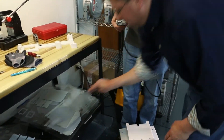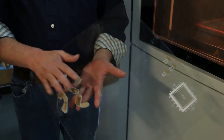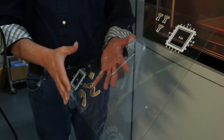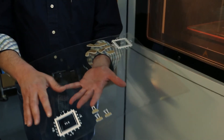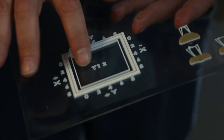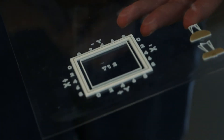We try to avoid that as much as we can. So tell me a little bit about the build plate. This is just a polycarbonate sheet that goes into the machine and gets sucked down to a vacuum table. You can only use one area of the build sheet once, and then we save the sheet so we can utilize the rest of it. So it's inexpensive and it's quick to just change these out. The calibration — you actually calibrate the two nozzles together. You're calibrating your X and Y using this scale here, and then calibrate the Z on this square here. This tells you what tip is in the machine, so you know that you have the right settings on it. If you try to calibrate with the wrong settings, it goes haywire. We've done that a few times.